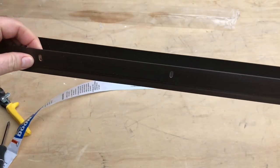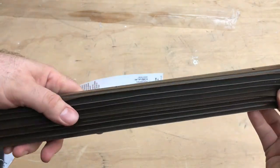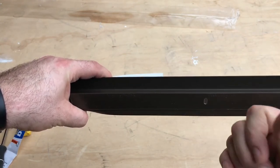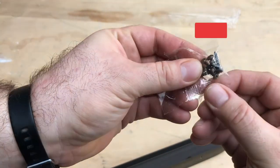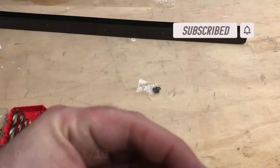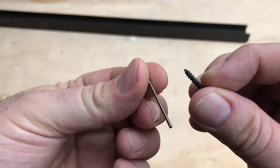This is going to be on the inside of the door, outside the door, and this is your bottom — it slides under. Mark your holes, drill. Got these little screws. Get a drill bit that's a little bit smaller than these screws — this is 1/16th — so I'm going to go with the 1/16th.